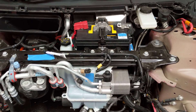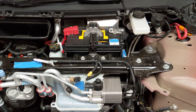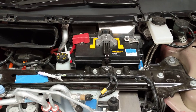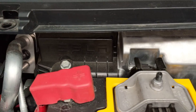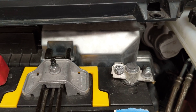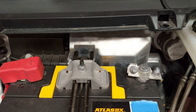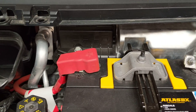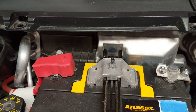Hello everyone. Today we're going to take a look at the main body controller in the Model 3, known as VC Front — Vehicle Controller Front. You can see the 12 volt AGM battery, and the silver and black box here is VC Front. This is where the 12 volt battery connects, distributing 12 volt power to the other two body controllers. There are no fuses, not even directly on the 12 volt battery — it's all done by solid state MOSFETs inside VC Front.